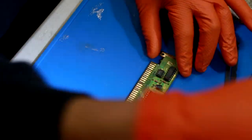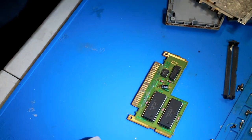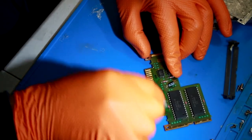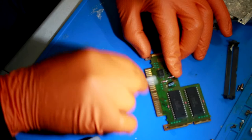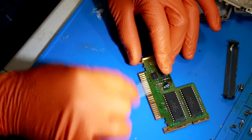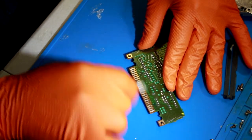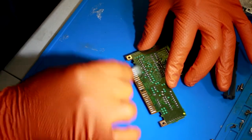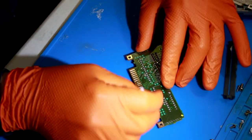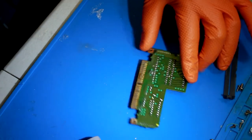The first thing I'm going to do is break out my multimeter. I'm going to clean some of this stuff off with alcohol and a Q-tip, get a better look at it, maybe run this through the microscope, and then check continuity to see if this is even worth messing with. Because I'm planning on selling this - I already own a copy - doing a trace fix is probably not going to benefit me. I can do some scraping and run thin wires, but is that fair to the customer? Probably not. It just depends on the level of damage.